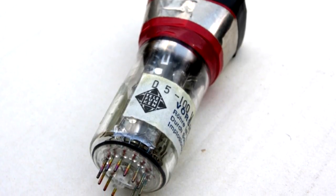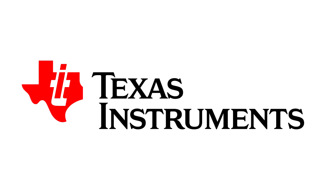Eventually the coffin-shaped tube idea was buried, and Sinclair Radionics decided to approach manufacturers who were already making tubes successfully. They contacted Thorne in North London and AEG Telefunken in Germany. In the end, Telefunken were most able to adapt to the requirements of the design. In particular, the Telefunken tube used a lot less power — about 50 milliwatts to heat the wire — whereas the Thorne one used about 500 milliwatts, over half the consumption of the whole set, which was prohibitive.